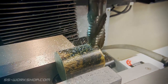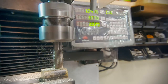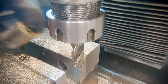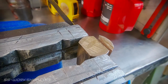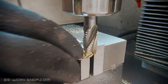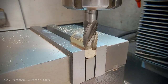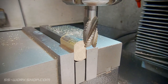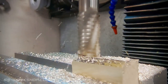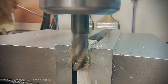I'm machining these from a piece of bronze bar using a 14 millimetre roughing end mill. I cut away some of the waste material using a hacksaw before heading back to the mill to continue machining. I then square and finish the cut side. Next we'll rotate the part 90 degrees and hold it using the two machined faces. The remaining two sides can then be roughed out.